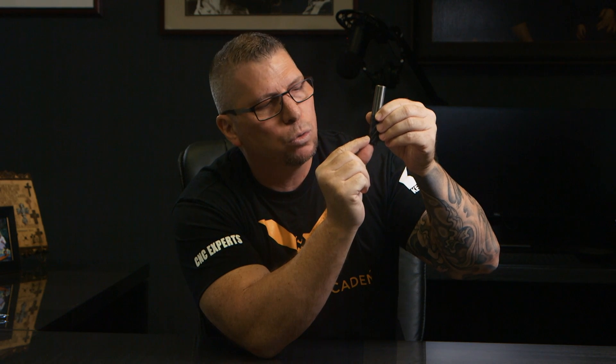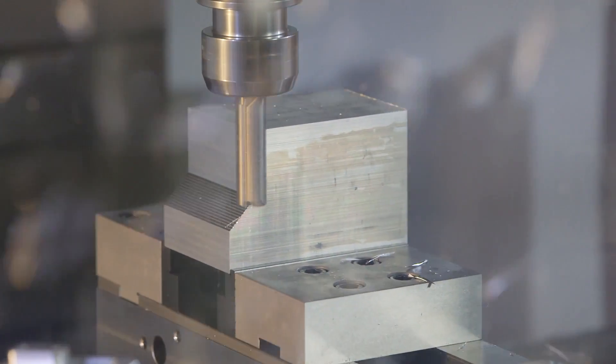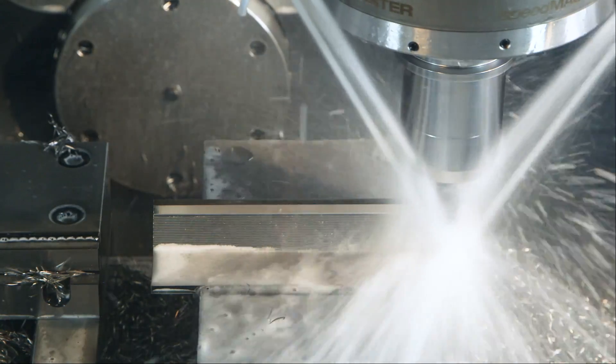Here's something people don't talk about: points of contact. This Harvey 3 is a six-flute tool. If you're just cutting with the tip you might have one or two points of contact, maybe three, with a lot of pressure. But as you drop all the way down, flute after flute after flute, each one is a point of contact. The more points of contact you have all the way up limits vibration and adds rigidity to the tool, giving you a better surface finish and allowing the tool to last longer. Points of contact is huge in both roughing and finishing. Running fast does not mean you'll burn up tools — the tools actually last longer because you've taken out the heat, added rigidity, and done everything necessary to be successful.